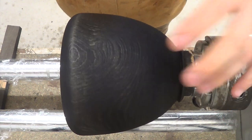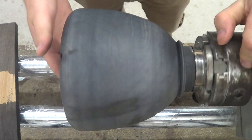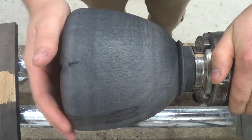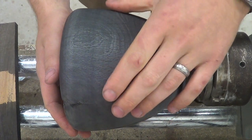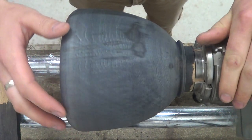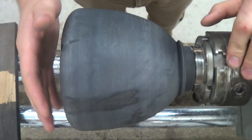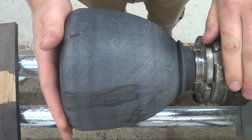It's just a case of waiting now for the reaction to complete and for the wood to dry. I've left it now for four hours. It's dried and I've sanded it with 320 and 400 grit because the grain did raise a little bit, so it's lovely and smooth again. I've got a nice uniform colour over the whole piece now. As it dries it does go a lot lighter — more of a blue-black rather than a black-black. So I think I'll give it one more coat, let that sink in and dry overnight, and in the morning I'll see how the colour is. If the grain has raised again I might need to give it another light sand, but I think it will be ready for finish in the morning.